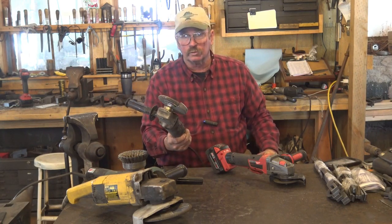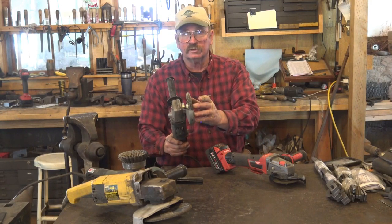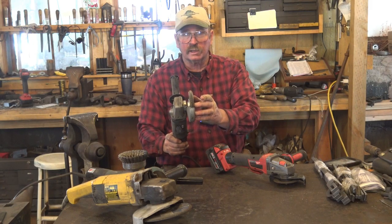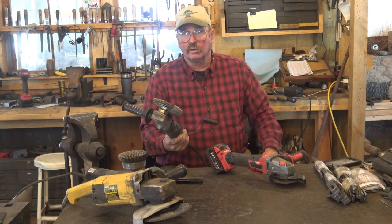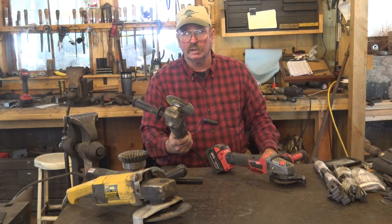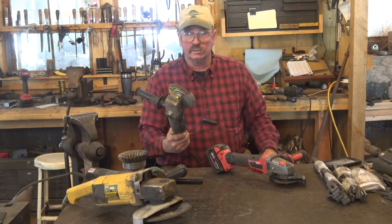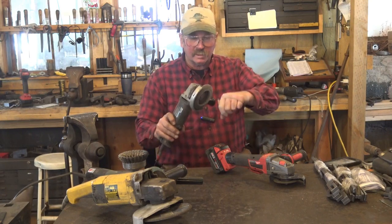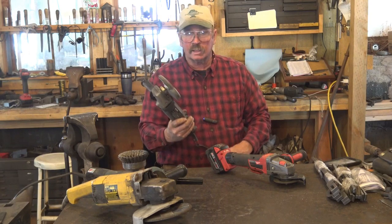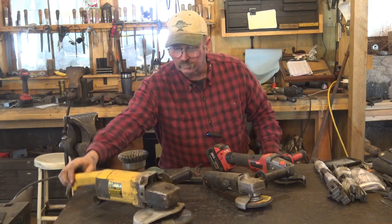This one is almost as old as the Makita — probably 20 to 25 years old — and it still works. It has a flap disc on it. You get these flap sandpaper discs in grits from 40 to probably 240 and maybe even finer. They're really good for a lot of things, and this is all the grinder you need for sharpening your tools — chisels, punches, hardy tools, dressing hammers. A certain type of flap disc will really do the job nicely. I would not advise holding a piece by hand while working with the angle grinder — that's not safe. Angle grinders can be dangerous.